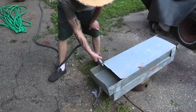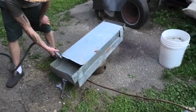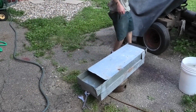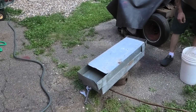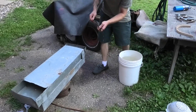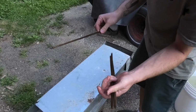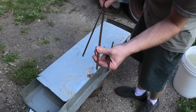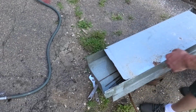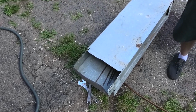We gotta bend some wood. Put in boiling water. Doesn't take very long. There you go. Just a few minutes. Here's our little pieces for the scrollwork supports, soaked to get better moisture in them. This is our cuts from the old piano bridge. Yep, one of those bridges in the shop. So we'll boil these for a couple minutes. Simmer them. They're already saturated with water, so it don't take long. When they come out, they should be ready to steam bend.